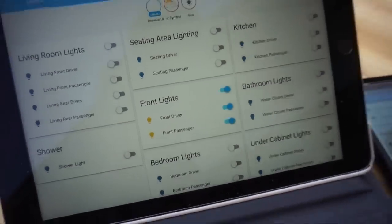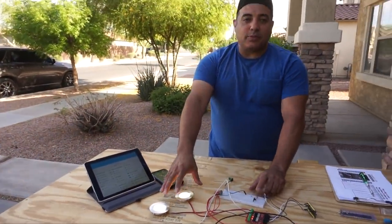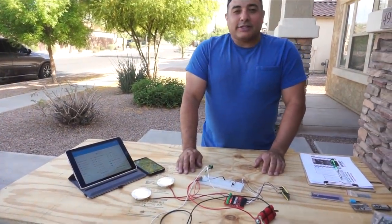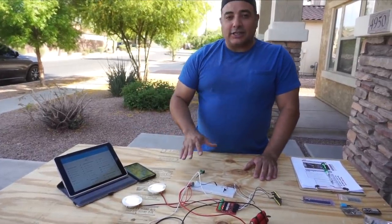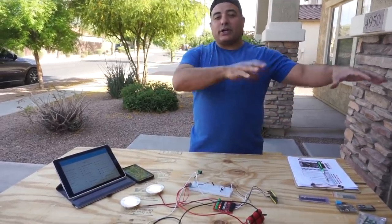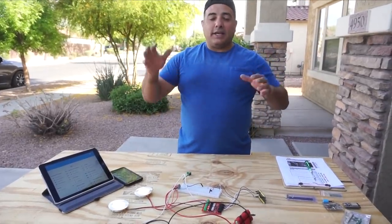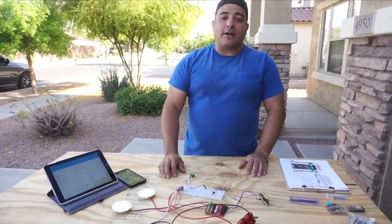We've also upgraded these little LED lights. We had some white ones, and now we're going with more of these. They're more like the aluminum color. So that's where we're at with sort of the lighting situation. We've divided the bus up into zones, and each of those zones will be controlled by a different pin, and they'll all be dimmable independently and be able to be turned on and off independently.